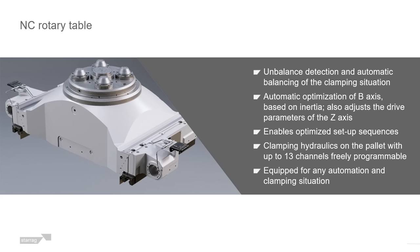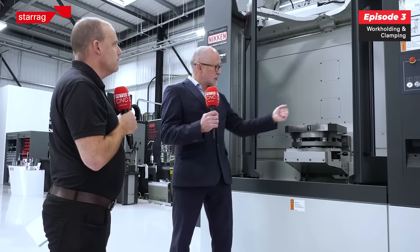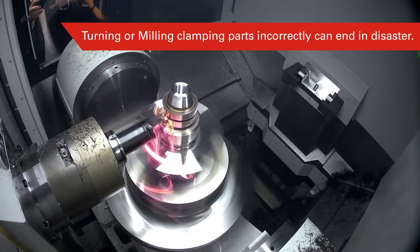It's very clean. Everything comes through the centre of the table and it's live. So you load outside the table — you can have a driven spare table or just a static table that you move yourself. You load your part, you clamp your part, the clamps automatically come on, and then that stays live throughout the whole machining process, even when you're turning at 900 revs.